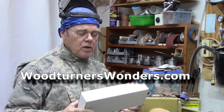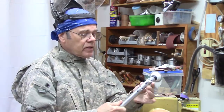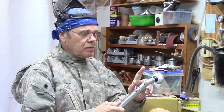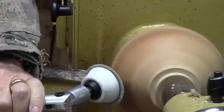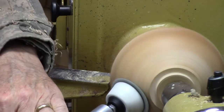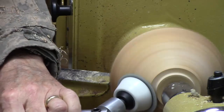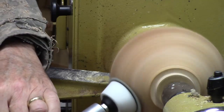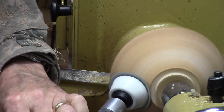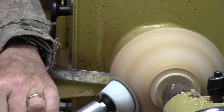I just got this new toy from Woodturner's Wonders — it's a Turner Turbo Wonder. It's an inertia sander with articulating arms so you can make a couple of adjustments, and it comes with a two-inch and a three-inch mandrel. I'm using a little bit of that sanding paste I made out of beeswax in an earlier video to keep the dust down. I had a pretty good cut, so I'm starting with 180 grit.